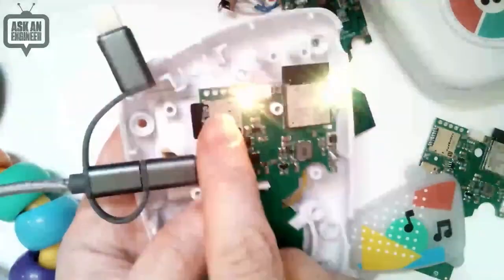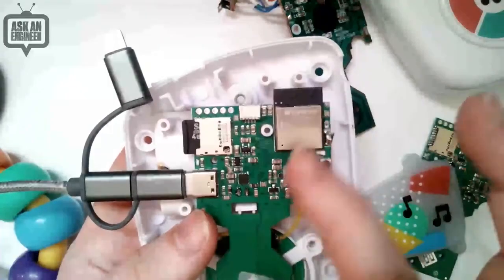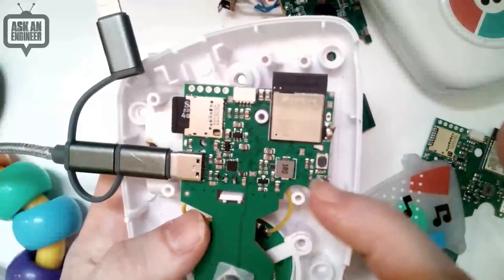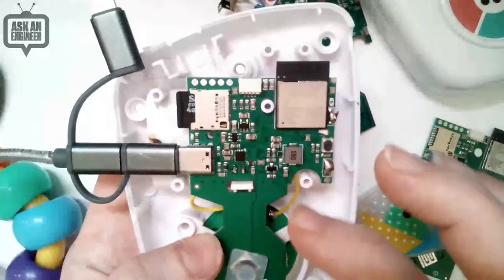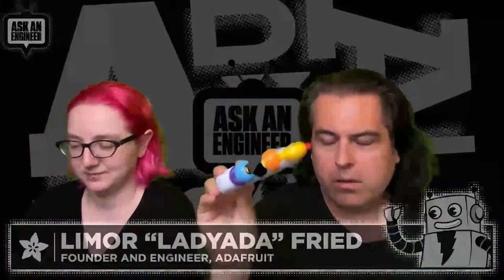Right now the button does play/pause - there's only one button, so just play/pause, also used for bootloader mode. The LEDs can do some cool stuff; I might have them do an FFT reaction so they react to the music. The I2S amplifier works, the SD card works, the ESP32 works, the NeoPixels work, and there's a reset button. I just have to figure out this boost converter, probably do another board spin, but it's fitting just right into all the slots.